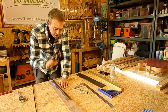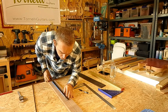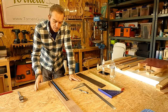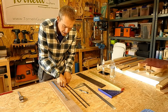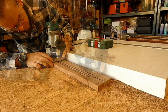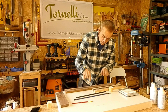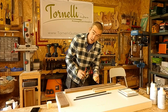So again, single piece neck — I've got some carbon rods going in. Sorry about the background noise, there's a farmer mowing his olive grove. What I'm starting to do is taper the carbon rods, which seems like a better idea than having them run completely straight. The channels are done and I'm using a slow cure epoxy for the carbon rods — I'll pop these in, clamp it down, and leave it overnight.